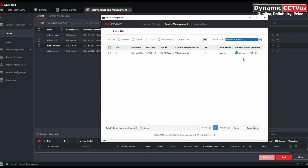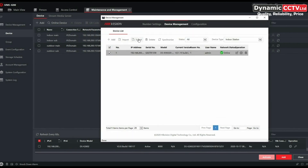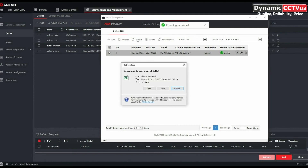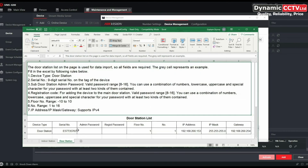Our first sub outdoor station is now online. It's a case of repeating that procedure for multiple sub outdoor stations — up to 16 on this latest firmware. Moving back to the indoor station, there's a configuration cog that allows you to view and edit certain settings. You can also export your station settings as an XLS file — handy after commissioning is finished so you can keep that with site records, or re-upload those settings to another station in the future.